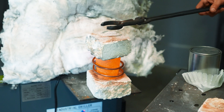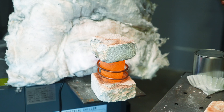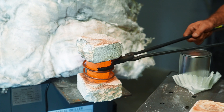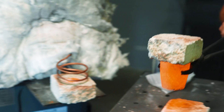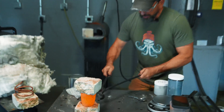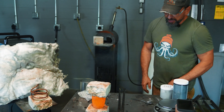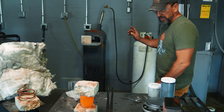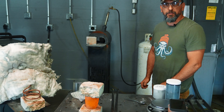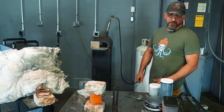We've now run it for 10 minutes at full amperage, and then we turned it down to half amperage and ran it for another 10. What we're trying to do is equalize the material inside so it doesn't have any gas remaining in the ingot. Now we're just going to let it cool down a little bit, knock the lid off, get it in the gas forge, and then forge it out on the hammer — hopefully, if all things work well.